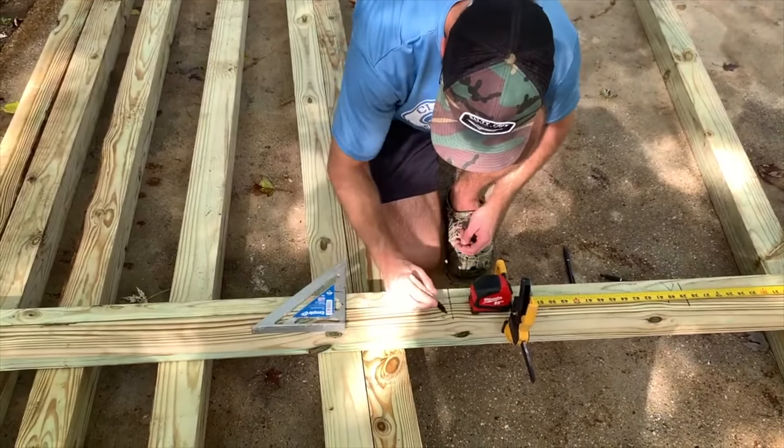As you can see, we're not experiencing any sliding because the front of that wall at the bottom is catching on those screws. And then we're just continuing to lift it until we have it perfectly vertical. Once we had it positioned, we did a little bit of shifting to make sure that the wall was completely flush with the edges of the shed base frame. And then you're also going to want to check the front of the wall to make sure that's also perfectly flush with the shed base frame.